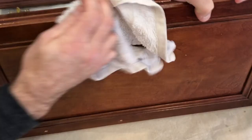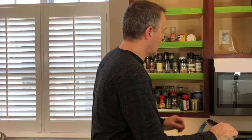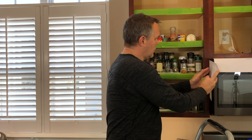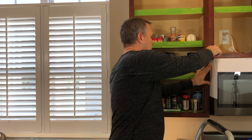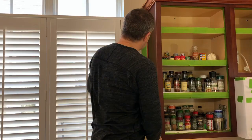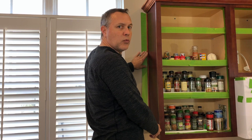When it comes to protecting your appliances that are surrounding your cabinetry, one of the things I found that was pretty effective is to take a piece of plain copy paper — maybe you can use an envelope — and place that between the cabinets and the appliance, then just put some tape on it to hold it in place. That way the tape isn't stuck between the cabinetry and the appliance and you don't have trouble getting that stuff out later. You also want to protect any wall surfaces that might be in the way so you don't get any cabinet paint on those.